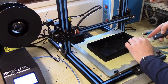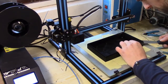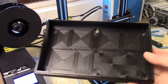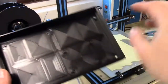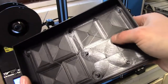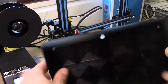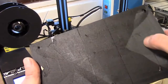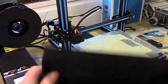Unfortunately when printing on tape it tends to stick like hell. You just have to pry it off very, very slowly. So basically this is the back side. Four screw holes in the end if I want to mount like that, or one in the middle. And this is where the Raspberry Pi goes. I did do the holes a little bit too small, and it's a little bit thinner on those points just to make it a little bit quicker to print. And as you can see there is tape — I didn't put down any nice surface for it.